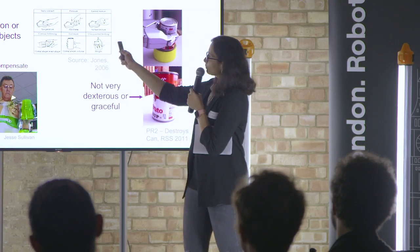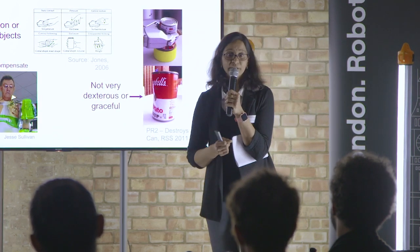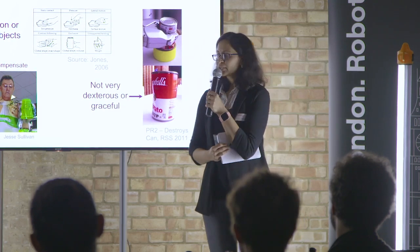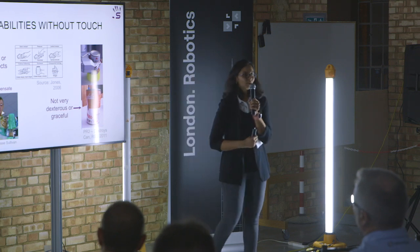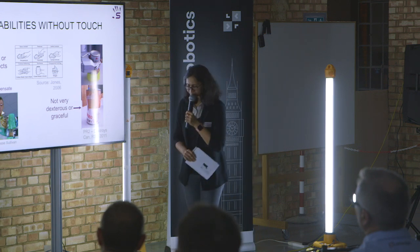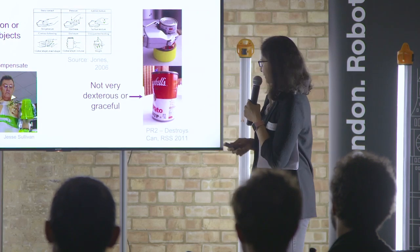And the bottom half, I think part of it you can manage with vision as well, but if you have tactile sensing together with the vision, you might get more information about what's the weight of the object or what could be the global shape, because the currently available vision systems, I think they are not quite successful in scenarios where the depth perception is more clearly required, or when the objects are shiny metal parts, where a lot of the systems that are available in the market fail. So in these cases, having tactile information always helps you in perceiving the object better, and then picking it up or grasping and manipulating it in a better way.